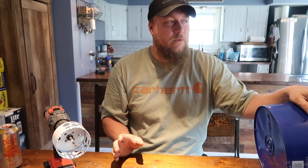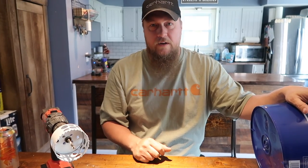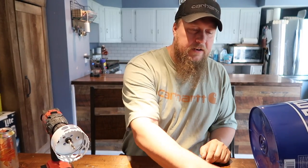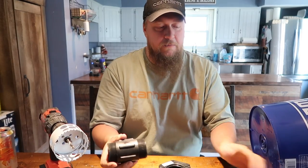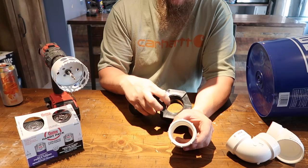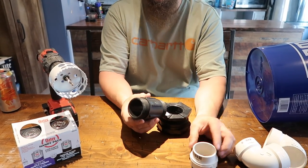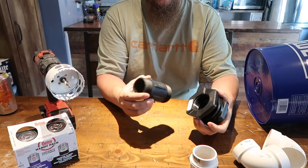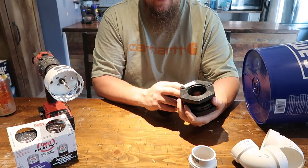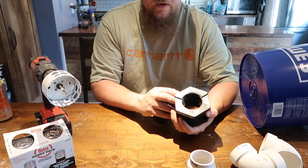It did not work at all with all those filters, and with this we have crystal clear water. So in addition to that, you're gonna need either a PVC male threaded to fit into this bulkhead thread, or I picked up just another male fitting to fit into this double-sided, same thread as this bulkhead. The part number on the bulkhead fitting that we're using today is TF200.